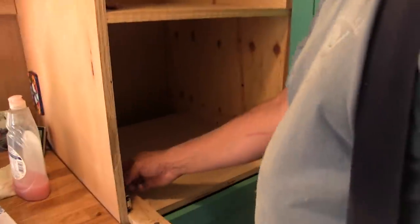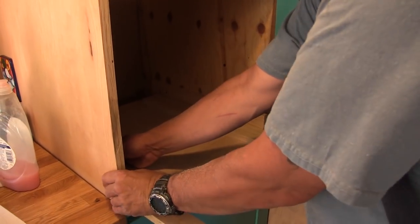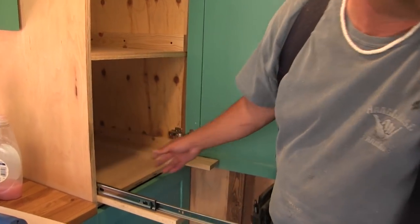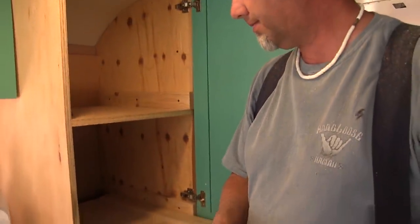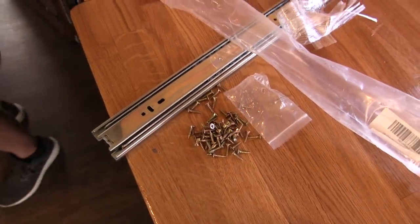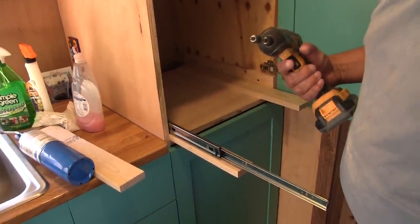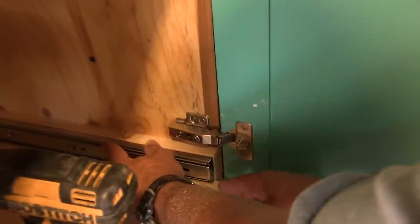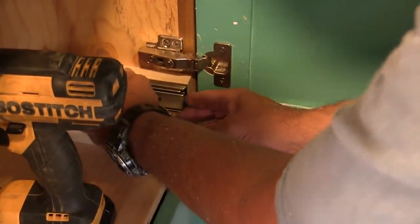Okay, so show us how you do this. You set the boards up as spacers for the bottom. I can't use my Kreg ones because it's up against the wall so it doesn't work. We just use a one-by-three, three-quarter-inch piece of wood underneath. These things close right to the edge of the drawer, so if you set it right to the edge or past the edge, obviously this won't close, so I set it back a little bit.